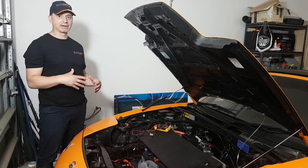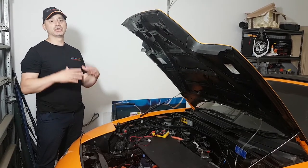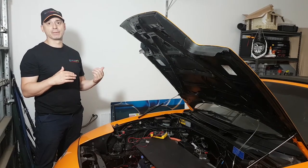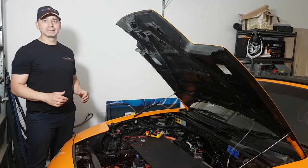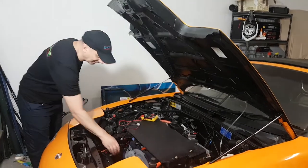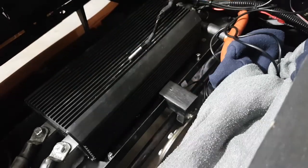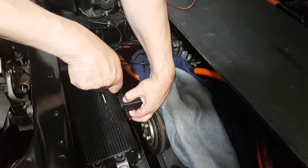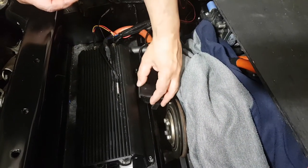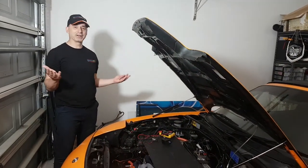I'm going to bolt all this into place now, which will allow me to actually drive the car and test it in a real world scenario. I may need to add some capacitors between the negative and the signal just to make sure the signal hangs down long enough to register on the tachometer, but I won't know that until I get the car moving up to a certain amount of revs. People have asked how I'm going to secure the magnets — according to theory they should just be magnetized in there, but I'm going to put a dab of super glue in there. I was going to put little elbow brackets in here to screw it in, but instead I've decided to just screw that into place and bolt it straight down with some little screws. Car running — see if the 12 volts actually does work. Some people say you actually need a much higher voltage. We're going to find out. See you soon.